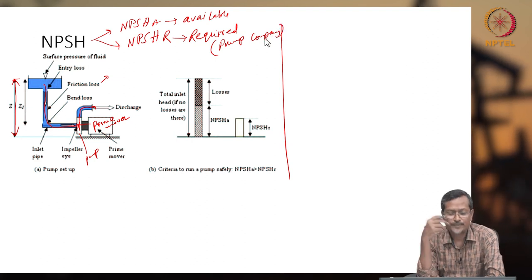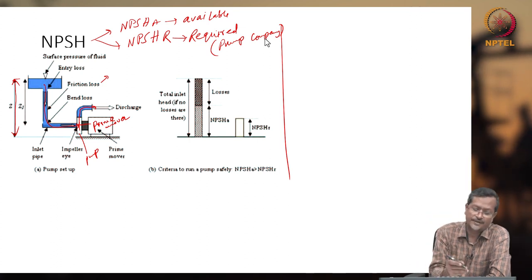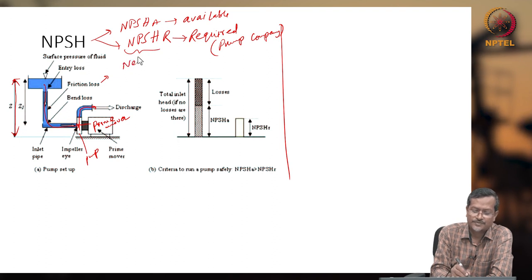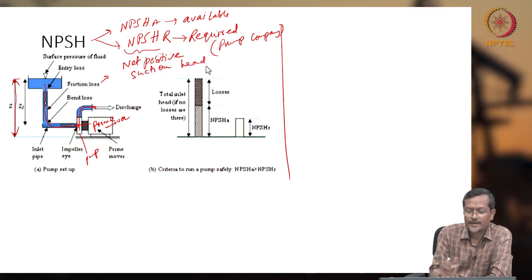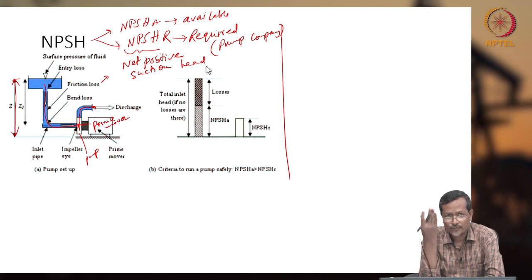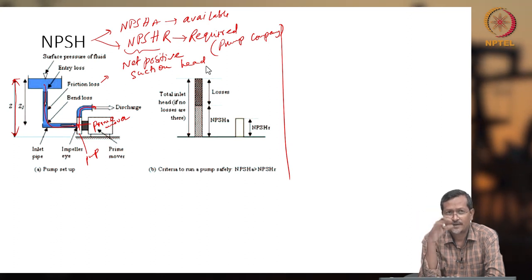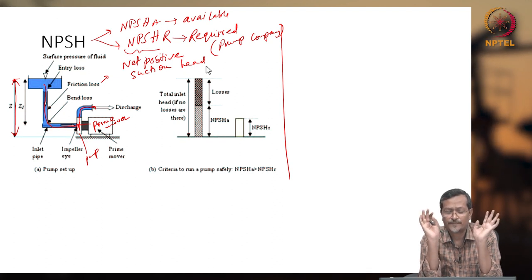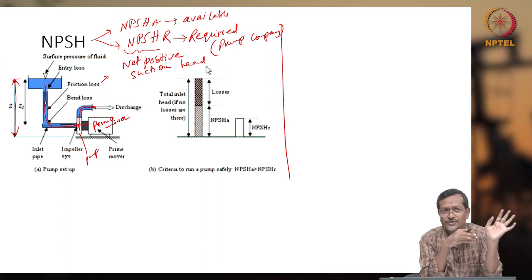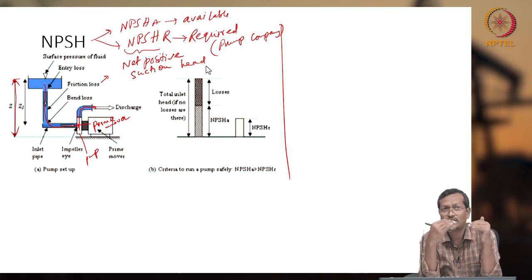Okay, when a pump company is developing any pump, they will be testing how much NPSH, or net positive suction head, it needs. So the full form also you should know: net positive suction head. So how much net positive suction head is required for your pump? The company will tell: okay, my pump will be requiring 3 meter head at inlet pressure. If you are not maintaining that much pressure, then your pump will be cavitating or there will be some problem. Okay, then as an engineer, your task is to read that document and ensure that your net positive suction head is not falling below that